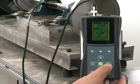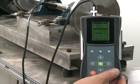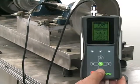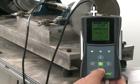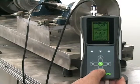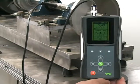The next screen shows the first of the five highest amplitudes and the corresponding frequencies. At peak one, it is showing that the most amount of vibration is happening at 1734 CPM, which is the same as the machine's RPM, indicating a balancing problem. Scrolling past the other peaks, we can see that they are all very low.